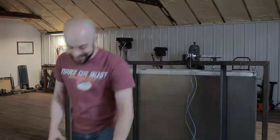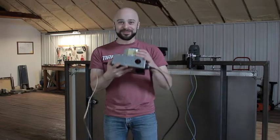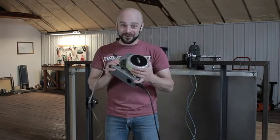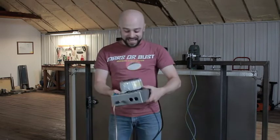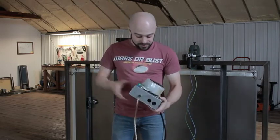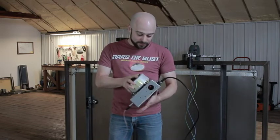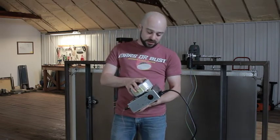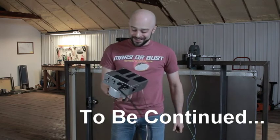The answer was to build a power supply using stuff I already have. I looked through my parts to find the biggest power transformer possible, and I think you'll be impressed by the results. I made this monster of a power supply — it is a beast. This thing dishes out 20 amps of 12 volts DC. It does work: I hooked up that motor and zing — we are in business. This is made from scraps; the case was used for two other prototypes before, and the power transformer was bought for a power amp I was building that I ended up not liking. It went on the shelf until today. Glad I found a home for it — anyway, we are good to go.